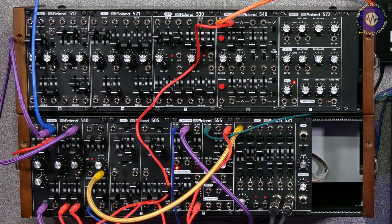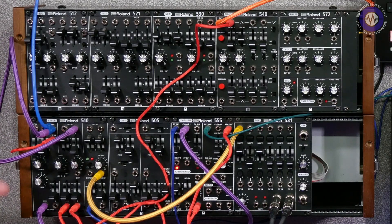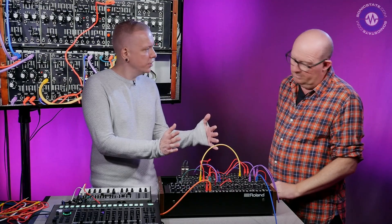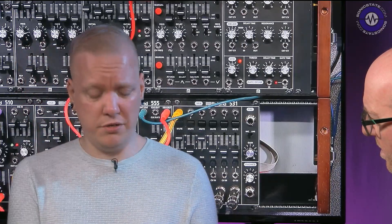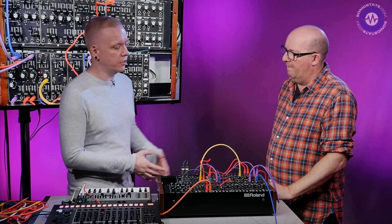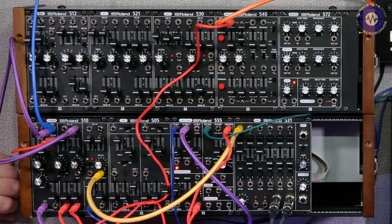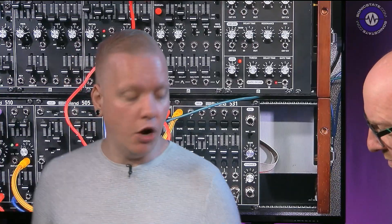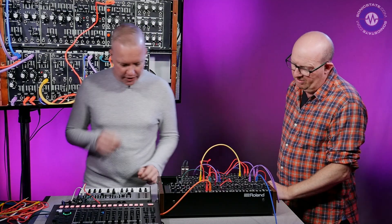So looking at these, the first one is not a full synth voice, but it's VCO, VCF and VCA, right? Yeah, correct. So the 510 is like an all-in-one synth module. If you're just getting started with modular, this is a good place to begin because it has quite basic functionality. Or if you just want to get the typical classic Roland sound into an existing modular setup, it's also a nice all-in-one unit. The nice thing with the 510 is it's actually hardwired — you don't need to connect the oscillator to the amp and so on. So that's a normalization.